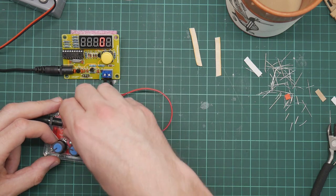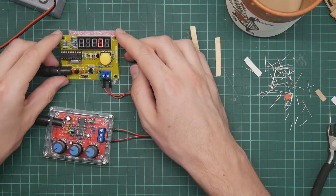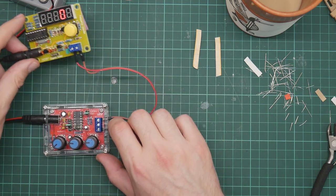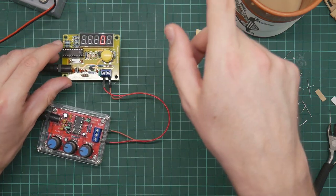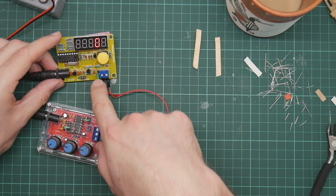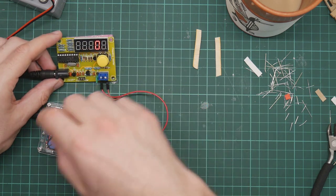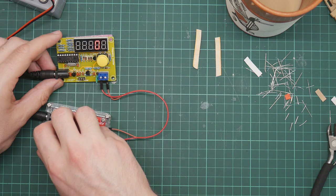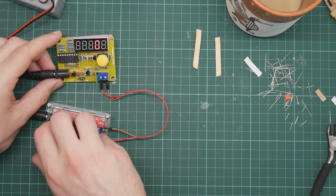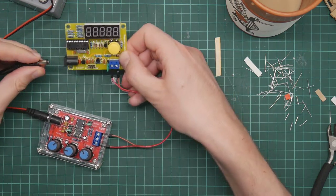So looking at the instructions, it does say before measuring signal switch J1 jumper cap, blue terminals for the in for signal input. Yeah, that's this one. So why is that registering zero? Is the amplitude not enough for it to register? It was working with the jumper removed.